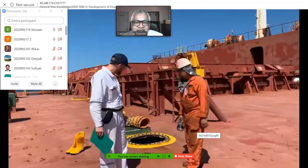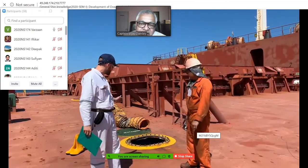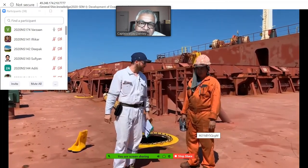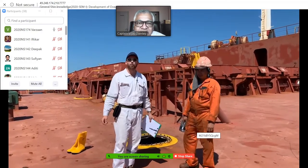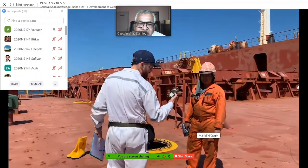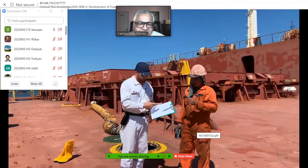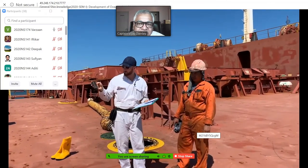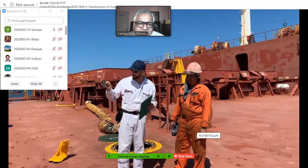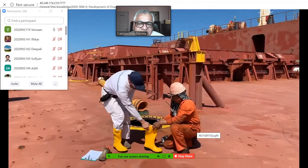One of the most critical operations on board is the inspection of the ballast water tank. This is a confined space and there really can be a lack of oxygen. In order to handle this problem, we are using the gas detector and the closed entry procedure. This is a special checklist. Calibration should be done in fresh air. We cannot use our standard safety shoes; we are using rubber boots.